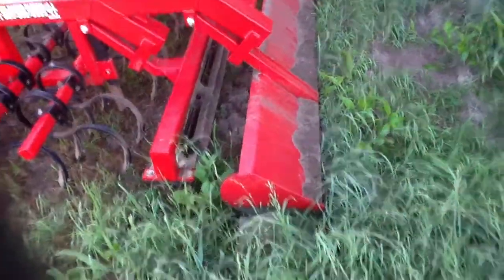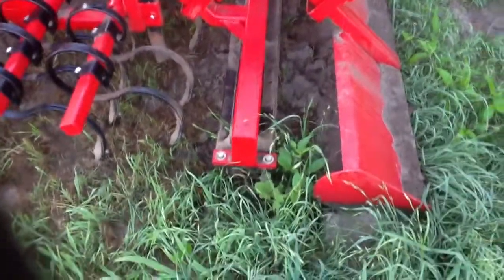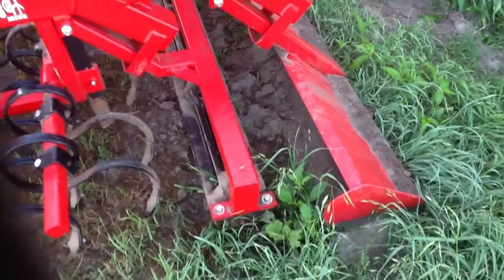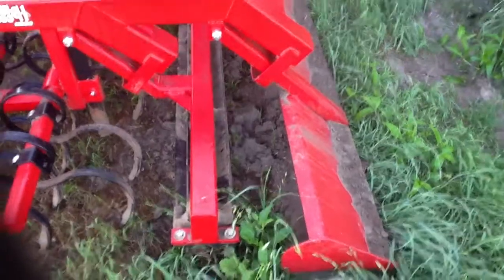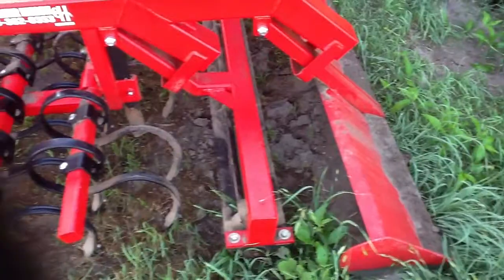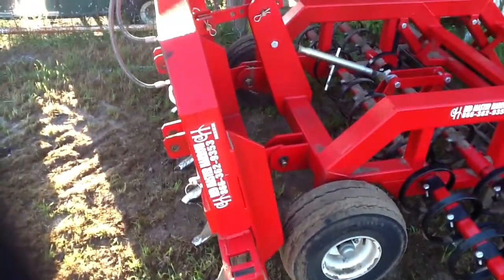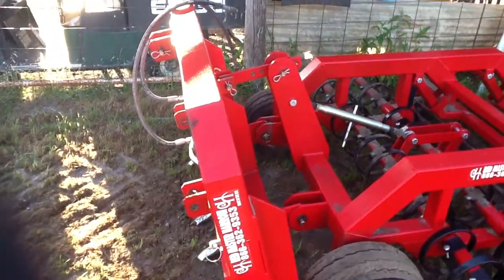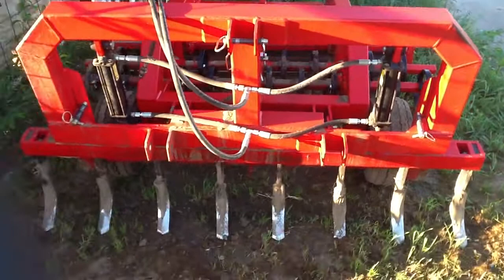Available options on the T-Rex: if you have ground that really likes to stay loose and doesn't like to pack, where this one has the paddle roller you can also insert another float pan for a little double packing. If you have the opposite problem — ground that likes to pack too much — you can insert a second paddle roller for a little extra fluff. Up front, this one has the hydraulic rippers but you can also get manual rippers. I would show that one in this video but I just sold it yesterday.